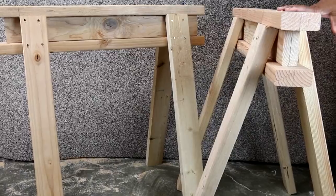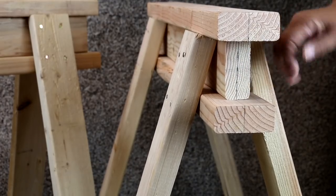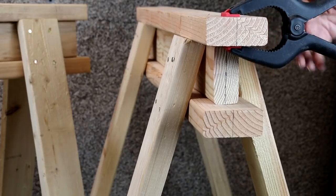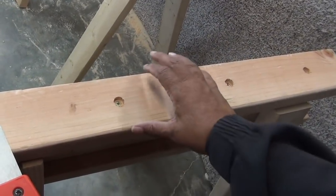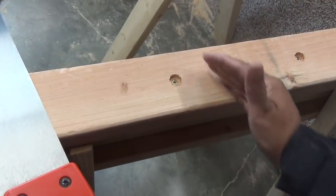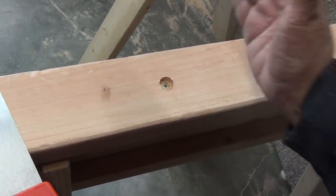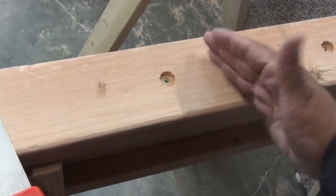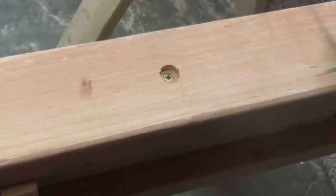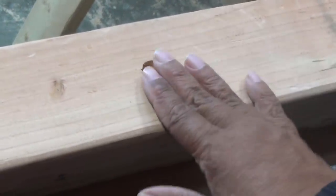These are our two sawhorses — they're complete. The center piece of the I-beam is recessed so that I can clamp to the piece of wood on top, in the event that I need to clamp something down. The top plate is sacrificial — sawhorses are always cut into, and once this takes enough hits, you unscrew it and replace it with a new piece of wood. You're cutting with circular saws and hand saws on top of your sawhorses, and that's how it gets all cut up. Also, I've recessed my screws, so if you are using a power tool like a circular saw, you don't have to worry about hitting metal — you're just going to hit the wood.